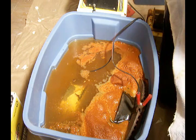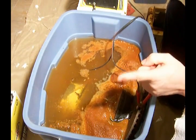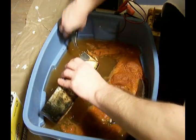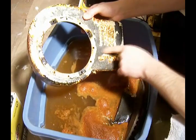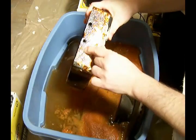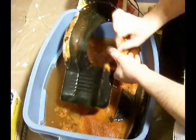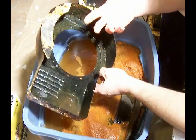It's now been 12 hours since we put this in the soup, and you can see that it actually does look pretty nasty by now. Let's pull it out and see what it looks like — and don't forget to unplug your battery charger. The paint is coming right off. Here's clean metal here. Most of the rust is gone and it just wipes right off. You have to clean it up a little bit yet, but some of the worst rust has now just turned to this black finish. We'll clean it up a little bit with a scratch pad and get this piece repainted.